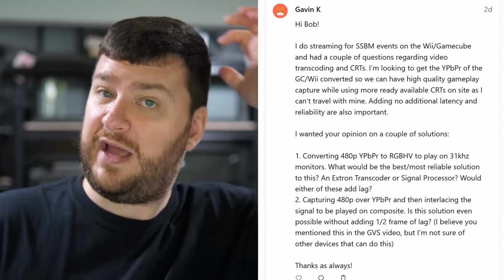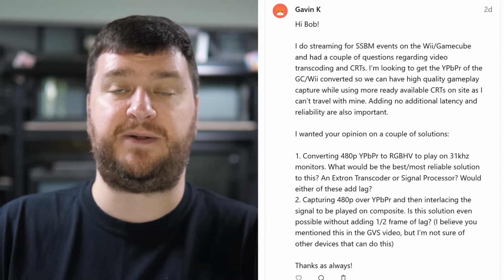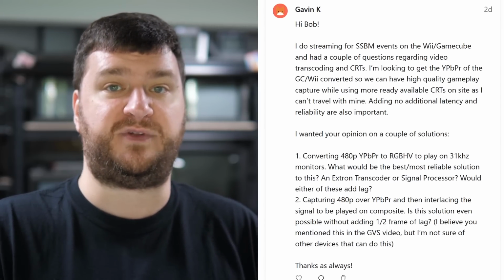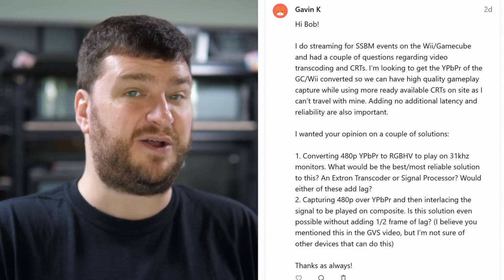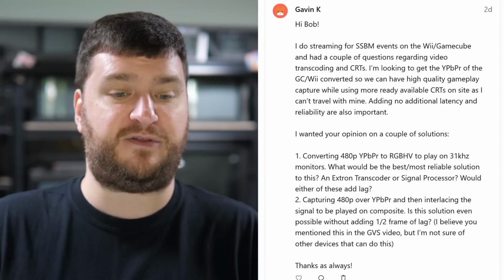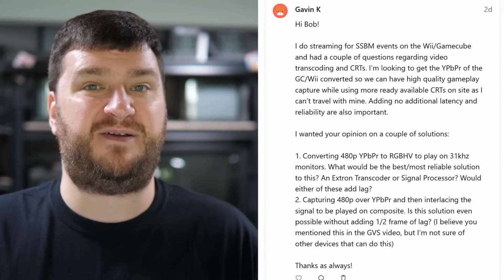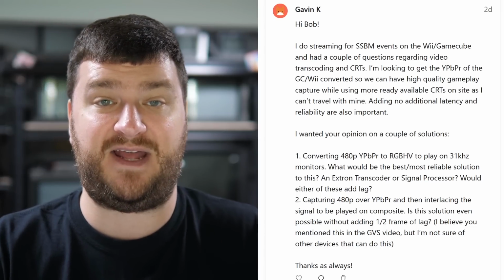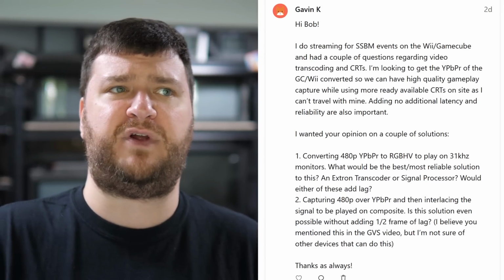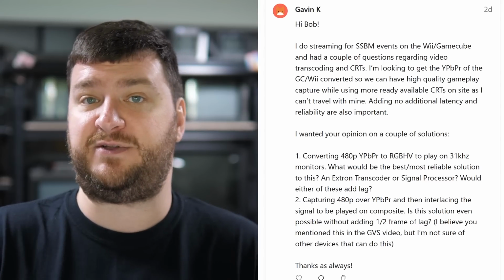The second one I would go to, if that's out of stock, I would double check to see if the VGA monitors you're using accept RGBS. And here's the thing, a lot of VGA monitors will accept RGBS, almost none will accept 15 kilohertz RGBS. So sending it that 480p 31 kilohertz signal, that would work fine. In fact, I have two monitors here, one right on my wall and one in the garage that do exactly that. So you could use the RetroTink transcoder to go from the RetroTink comp to RGB, and then you would just need a SCART to BNC cable, and that would certainly work.